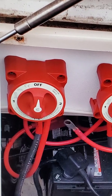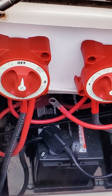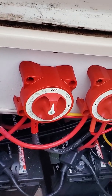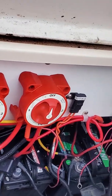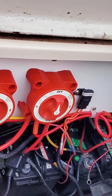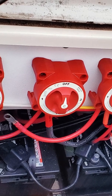The battery switches are now installed. Battery one is for the starboard engine — if I put that on selector switch one, it'll just run on that engine. I've daisy-chained battery selector switch two. If I put the house batteries on 'both,' the house batteries feed the house and then jump over to battery selector switch two, which jumps to the port engine battery selector switch two, and then to the starboard engine battery selector switch two.